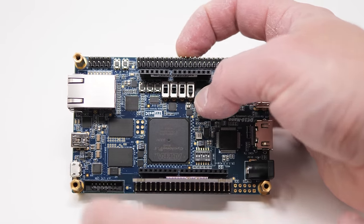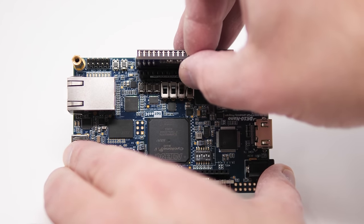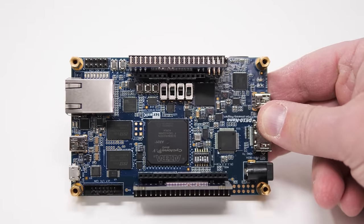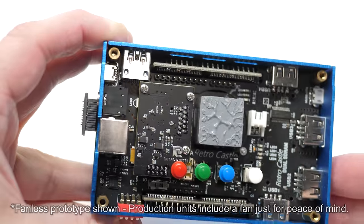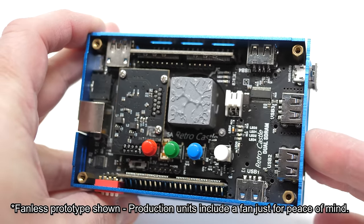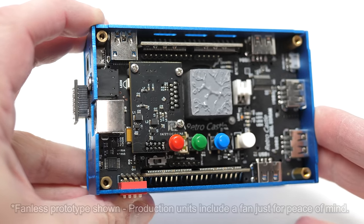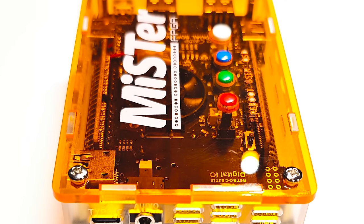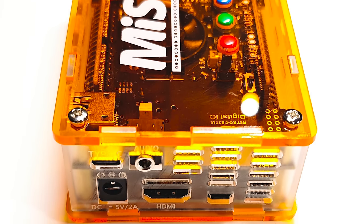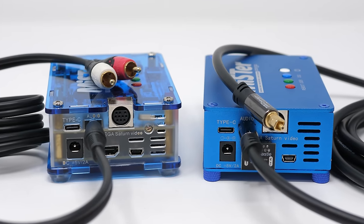If you're using dual RAM, make sure they're all back to the default position except the one closest to the HDMI port. The dual RAM version requires digital-to-analog conversion on both the audio and video side. For audio, it uses the same DAC chip as the HDFury 3, which is a tiny bit better quality than the I2S version. The HDMI-only version is fully digital, so it only outputs digital audio through the 3.5mm jack, not analog at all.